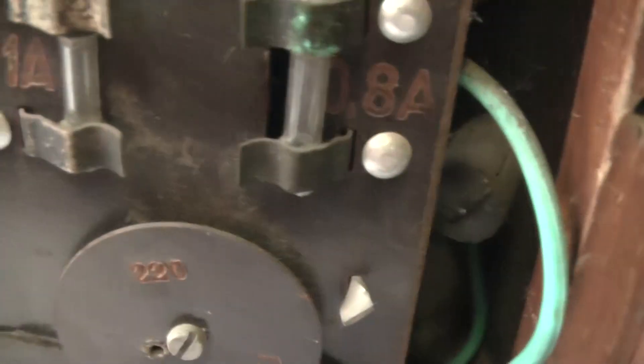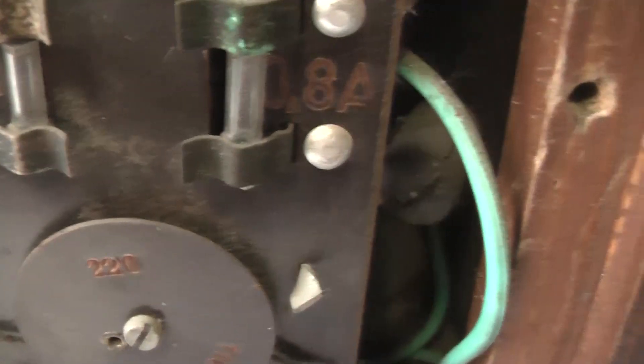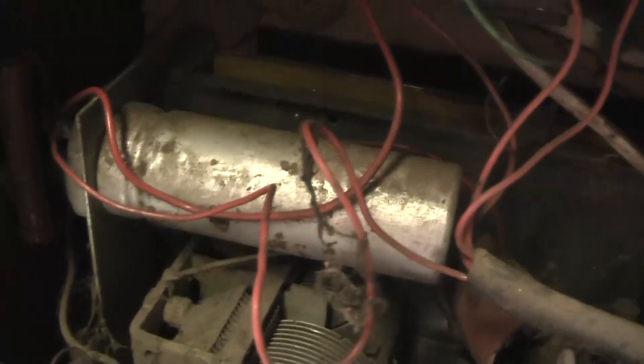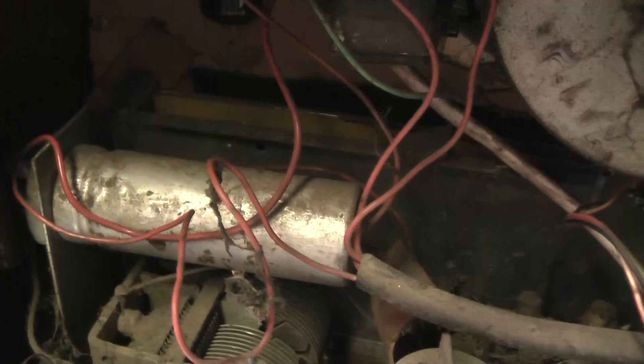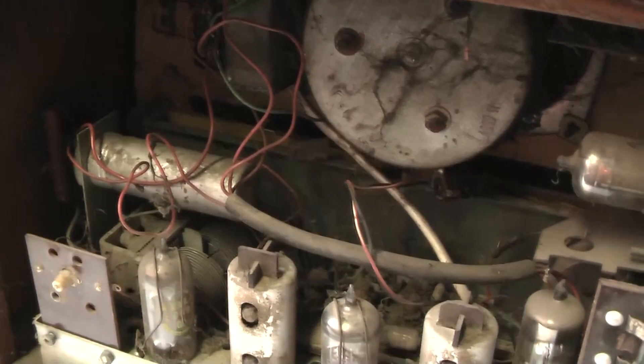I then cut the capacitor which goes over the mains line — the capacitor of death — it had a crack in it, so I cut through the lead going to it with a snip. And then I was going to test the filter cap, the 2 times 50 microfarads, to see whether it had managed to reform or whether it was getting hot. Not suspecting anything, I grabbed it — just to check whether it had heated up or remained cool. And I got a mule's kick.